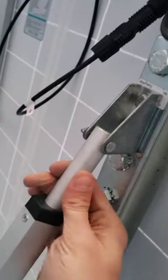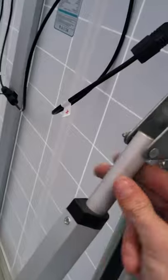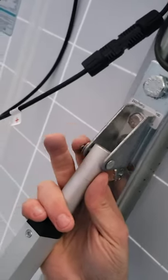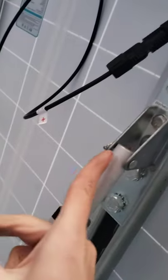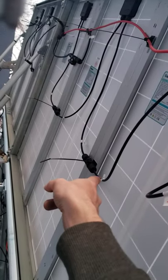You can adjust these actuators, but they're a bit tricky. You turn these on both sides — there's a cotter pin on one side and a flat head on the other. You slide them through, put a washer on one side, then put the cotter pin in to secure it.